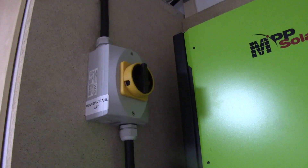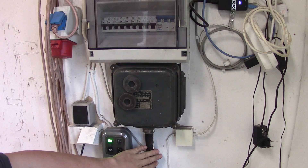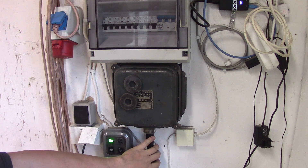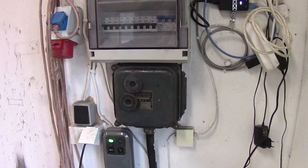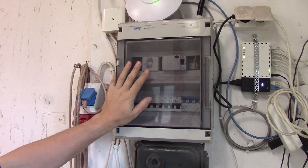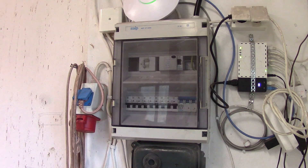Let's take a deeper look at the central itself and how it's connected. Here is the incoming line from the power grid — it actually comes from my distribution pole into my garage, and this is just to connect this big fat wire with my box up here. It's a rather simple box and this is only for the power for my garage. That cable goes to the inverter — it's 10 square millimeter, five wires inside for a three-phase system including neutral and ground.